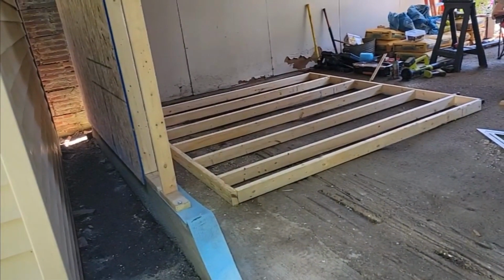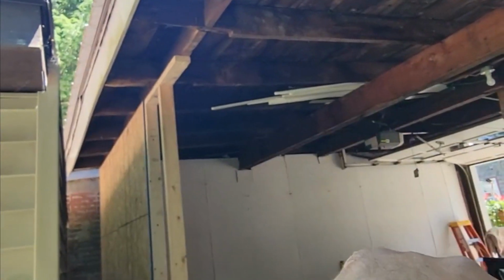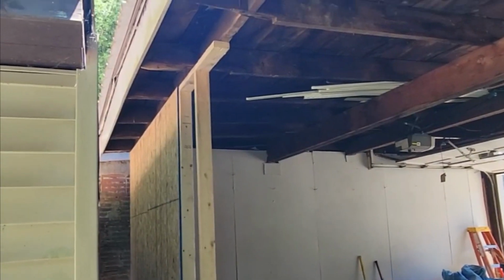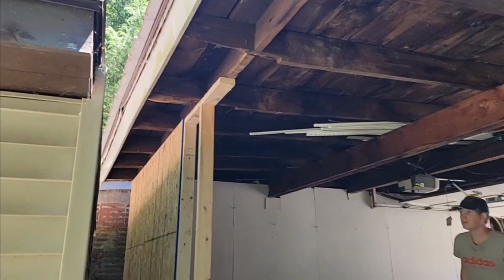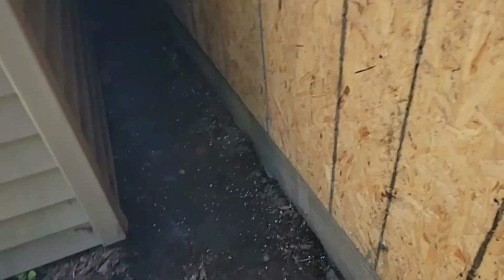So this wall, we're going to have to stand it up and do the sheathing outside because we got a sag right here. We can't put our jacks in the way and then try to bring the wall out. So I'm going to do it in that order. All right, we got 4 sheets of OSB on there. We're leaving an opening in the wall.